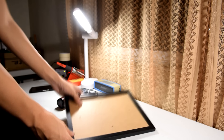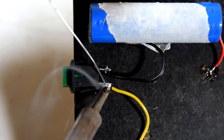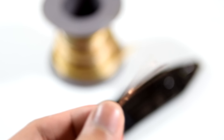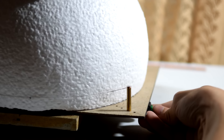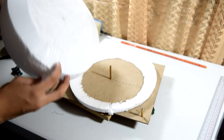For the makeshift styrofoam cutter, I recycled the wood from a broken picture frame and used it as the base for my components. I soldered a switch, a lithium battery, and a coil that I stripped from an insulated wire. When you press the button, the coil heats up and turns red. Finally, I mounted a metal standoff or pin as a pivot point for my styrofoam. With this, you can make a perfectly beveled edge for BB-8's head.